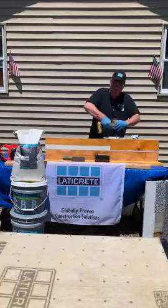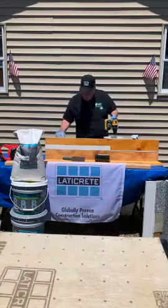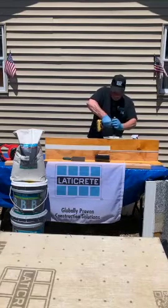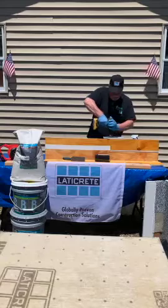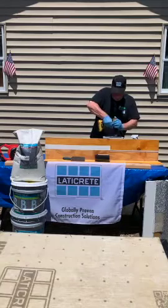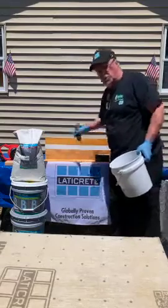Cove is very, very heavy when you put it up for it to hang vertically. Okay? Looks like we got that. So what we're going to do then is add in our 5 ounces of part B. Mix ratio. That'll give us our quartz blend. And this is low odor quartz and cove base, so you won't have to worry about the odors of it. I am going to put a respirator on here in a minute. That's just to show you another technique that I use.